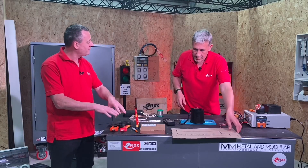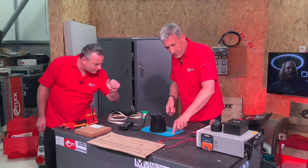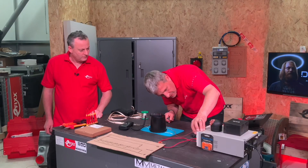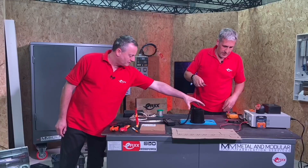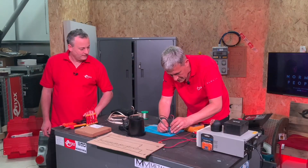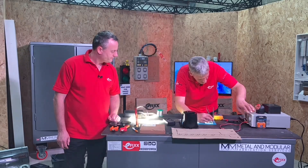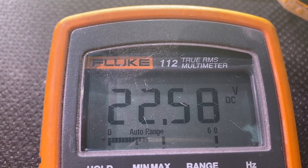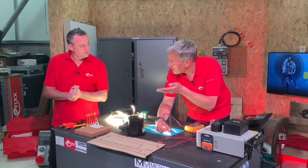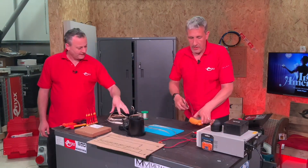Let's verify by measuring the voltage at the end of the Osram strip. We set 24 volts at the power supply. At the end of this strip we're getting 22.5 volts — so there is a volt drop along the strip as expected. But as we proved, the output of the LEDs hasn't fallen off because it's got constant current regulation.